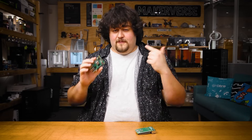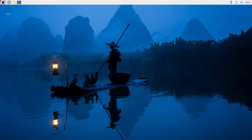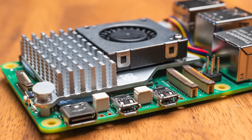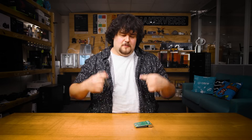But what is a spec sheet without actual performance? Benchmarks — you can make anything look good on paper if you try hard enough. We've briefly touched on these benchmarks in the review video of the Pi 5. The Pi 5 not only beats the Pi 4 on paper, but in every single benchmark we performed, and by quite a significant factor. All benchmarks were performed running an early alpha build of Bookworm OS, the new OS for the Pis. The Pi 4 was cooled with an appropriate heatsink and fan, and the Pi 5 with the official active cooler. Both resulted in no thermal throttling in our air-conditioned office, and both Pis were powered by their respective official power supplies.